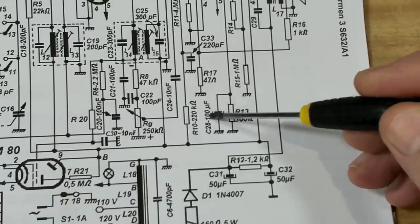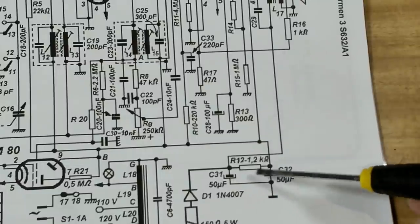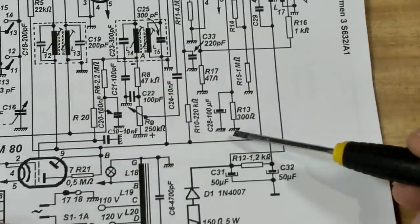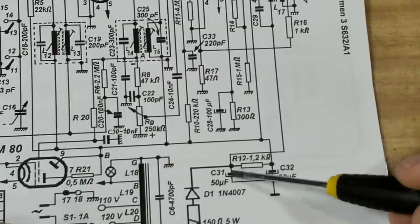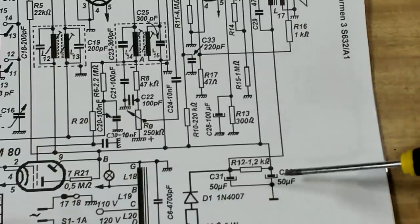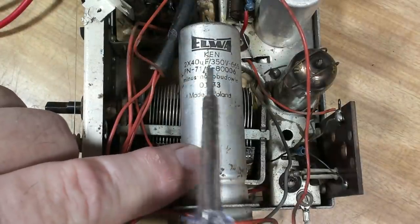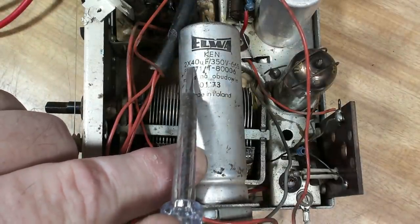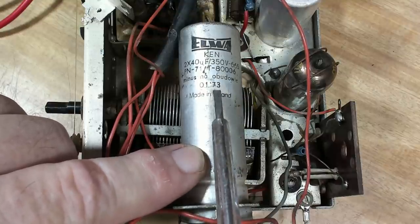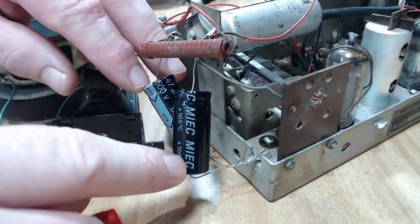The two other electrolytics are both 50µF and those need replacing - they may be what's causing the overheating of that wire. Unlike what I normally do, I'm going to replace these capacitors first before anything else, and reconnect the wire that's come off. The filter capacitor has '2x40µF' but should be 50µF. The replacement capacitor was made in Poland and date-stamped 1973. I'm pretty sure this radio is from the first half of the 1960s.